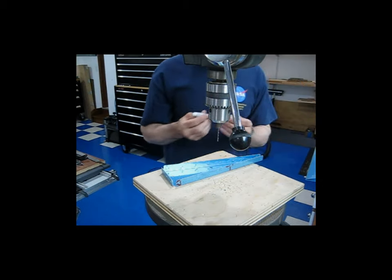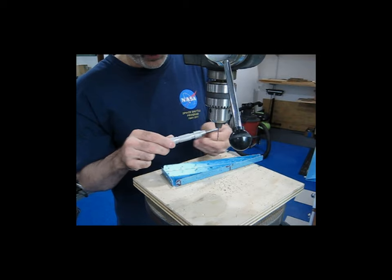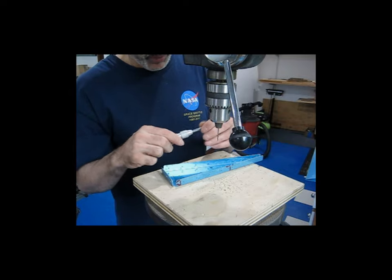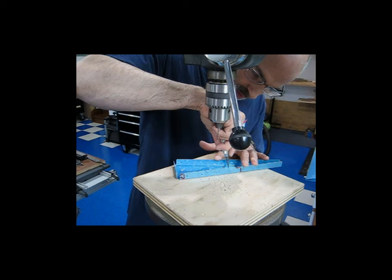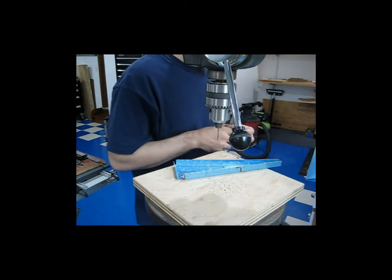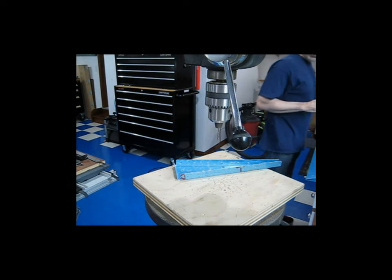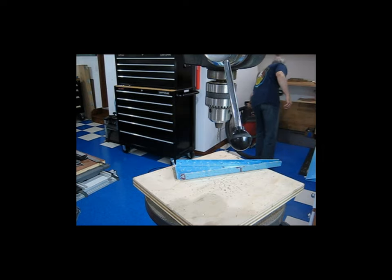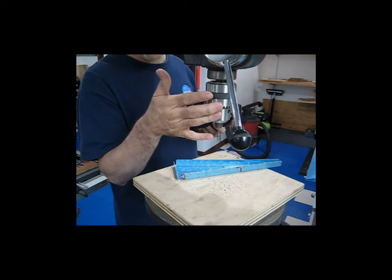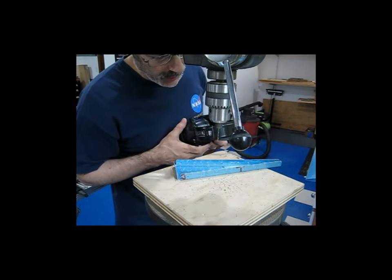The other thing that I like to do is I have this center punch. It's adjustable. You can spin the end of it to adjust the tension when it snaps to make the center punch. For this thin aluminum, I loosen this up quite a bit. And I'll go ahead and center punch the marks that I had made, just so this little tiny drill bit will find that really easily. I've got my magnifying glasses on so I can make sure I get it in the right location. I'm going to use hearing protection. I've got the drill press set up on the highest speed that it will spin, because this is nice and thin and it's soft. And I'm going to drill those holes.